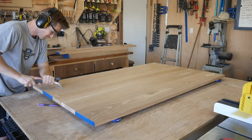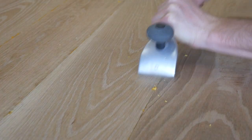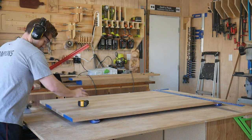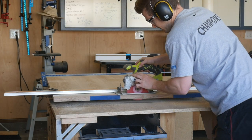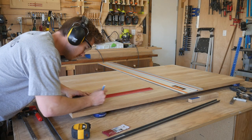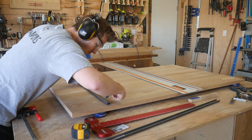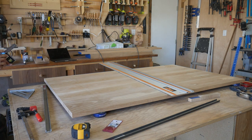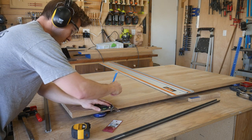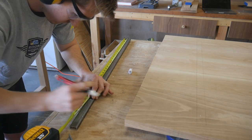The bases of the table and the bench are now assembled — I've got the table behind me, popped out of the clamps and flipped upside down. I'm going to do some general cleanup, get rid of excess glue, and do a little sanding. This is actually one of the flattest glue-ups I've ever had. Because it's hardwood, I'm going to add some steel C-channel to the bottom by routing out a groove all the way across, cutting the C-channel to length, and popping it in with screws. That's going to prevent any flex over time with changing weather or environments.